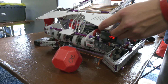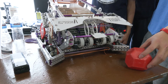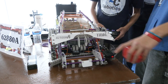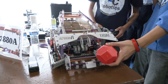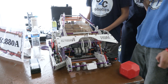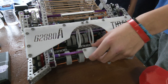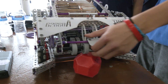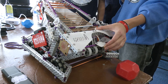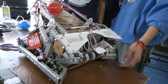For our front intake, we decided that in order to be fast, we need to be light. So instead of having separate sweeper mechanisms, we integrated our entire front intake for ground intaking. For the match loading stage, it's powered by two pistons which help wedge the robot into the match loader and intake blocks. One challenge was that the pistons were originally fixed to a single point, so every time a block went in, the whole robot would lift up. To compensate, we made two small mechanisms attached to the piston so that when it lifts, the intake moves up with it — this helps with easier intaking and stops the robot from jumping.